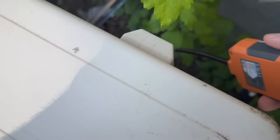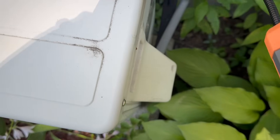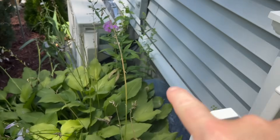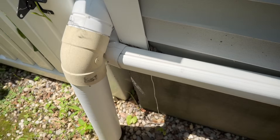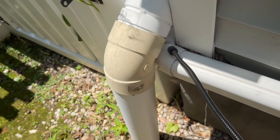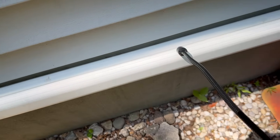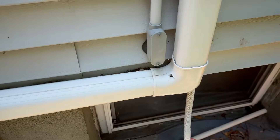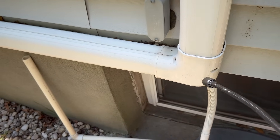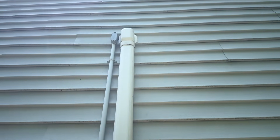You can also take the front cover off and get in a little bit closer to the coils. I know this unit does not have a leak because it is working quite well. The refrigerant lines run along the side of the house, they come out and bend over here. Anywhere there's a bend, you could theoretically have a problem in the flexible line, and you may want to take the plastic covering off this conduit to check. Over here there's another bend — a place where you could potentially have a leak. Inside the mini split on the wall, you'd pop this cover up, see the coil, and sniff around where the coil is and where the connection comes through the house.